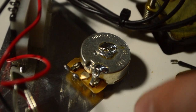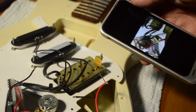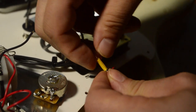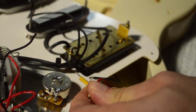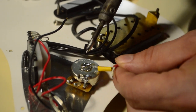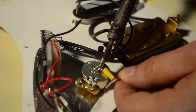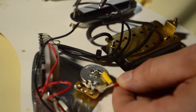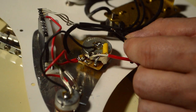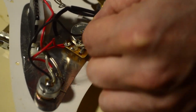Using the photo we took, decide where the wires go and put them there. If you have cleaning solvent, it's a good idea to take advantage of having the guitar open and clean the pots on the inside now. It's dirty contacts inside the potentiometer that cause damage — moving that dust around over time wears out the brass on the inside and causes the potentiometer to fail and become intermittent. That's how we ended up in this mess in the first place. If you're having trouble getting the wires in place, move the faceplate around until you make the slack you need.